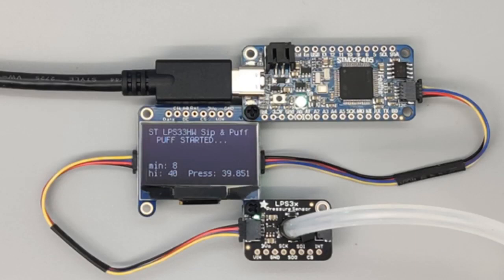This is a new learn guide from Brian: the STM32F405 Feather running CircuitPython with an OLED display and a pressure sensor with a port on it. The port has tubing connected to it, turning it into a sip-and-puff sensor. Brian did a really interesting structure with a callback system for different sip-and-puff strengths — a weak sip or a strong puff triggers a callback so you can perform different functions based on what the pressure sensor measured. This is for making alternative user interfaces, sometimes for accessibility, but also things like controlling a puppet with your mouth or using breath pressure to control mechatronics and robotics.